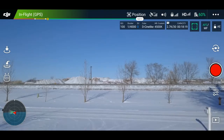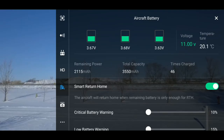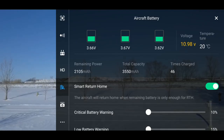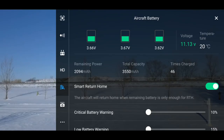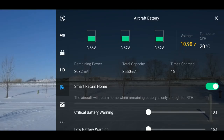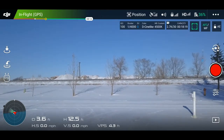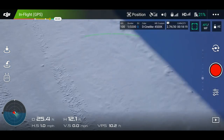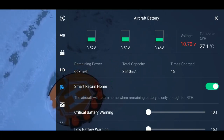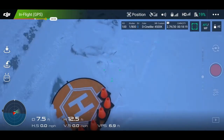We're at about 60% battery. Let's check the temperature — it's at 20 degrees Celsius and continues to climb. We're still getting a good voltage, about 11 volts — getting down there a little bit but still within operational parameters. That brings us down to 20%. Battery temperature is now 27.1 degrees Celsius and still running a little over 10.5 volts. Let's go ahead and bring it down.